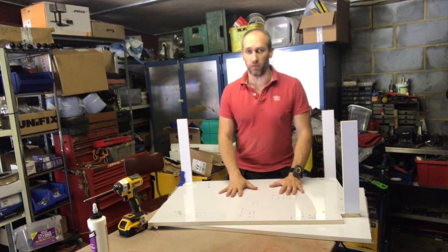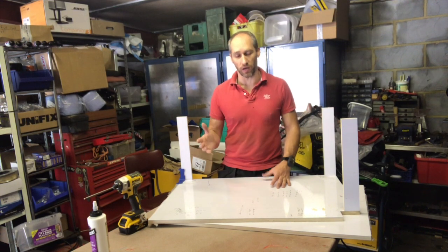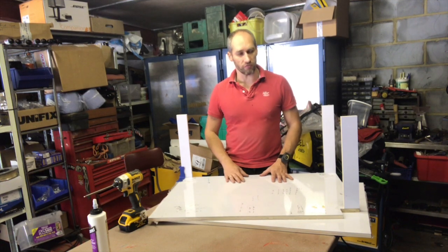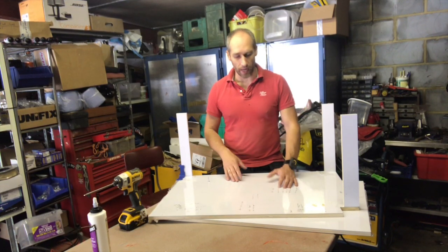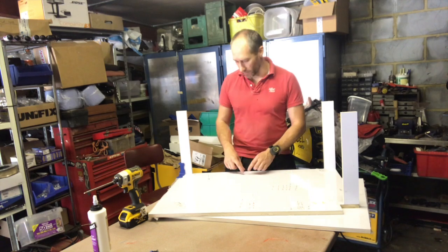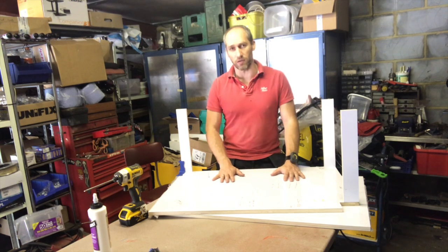It's time for the construction of the drawer unit. I'm making the kitchen as separate units, but it's going to be different from an IKEA or B&Q pre-made self-assembly kitchen in that it's going to make better use of space and it won't be so heavy. We're using lightweight ply - chipboard, which is what kitchens are normally made of, is very heavy. Also with a standard kitchen each cabinet has its own upright, but we can actually share uprights, which saves material. We will need to add a piece on the edge for hinges, but we don't need to double up on upright structures, saving a lot of weight.